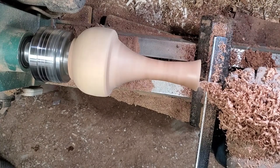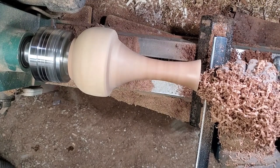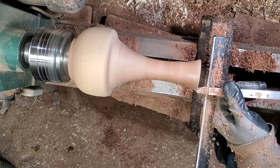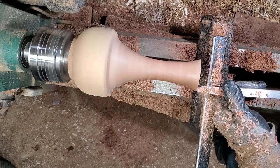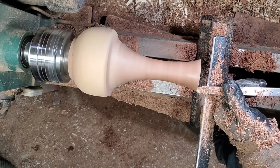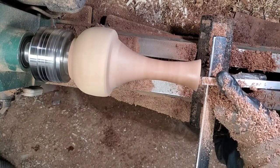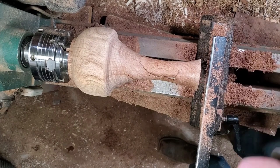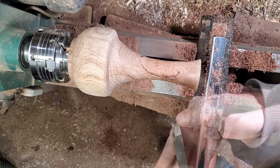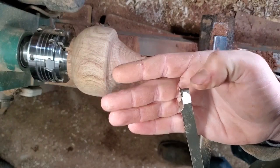I'm going to use my little carbide — I love this 8.9mm carbide. You can get this shaft and carbide for $35 off Amazon, I'll link it in the description. You've got to make your own handle but it's not that hard and you get to make it to a longer length if you want. One downside of these carbides is if you've got a tight area — you can see where it's burnishing, where it's rubbing — so I might take that down later on.